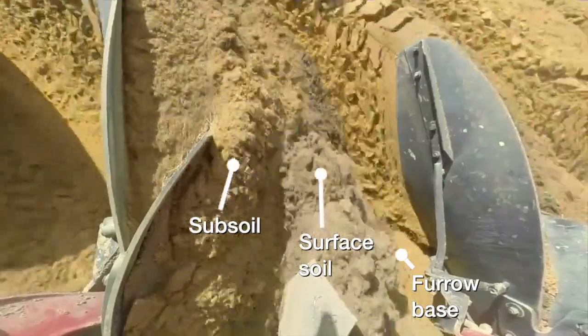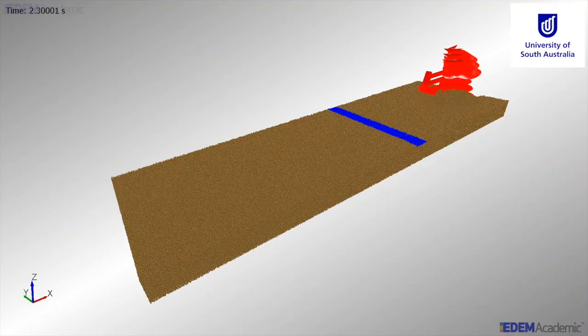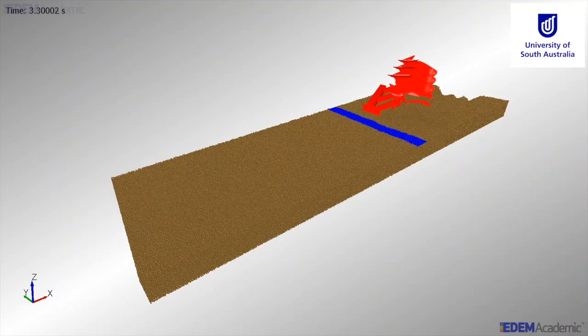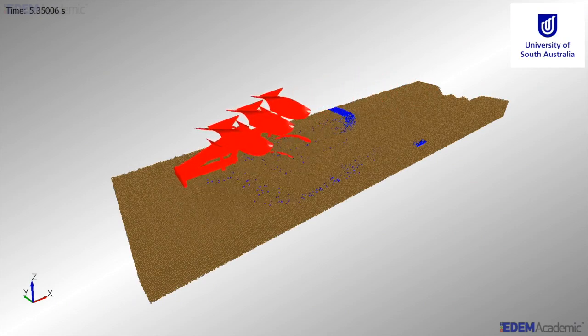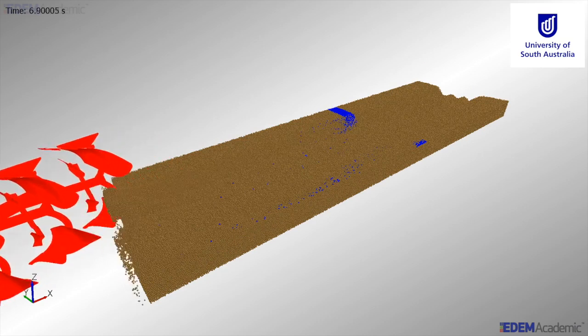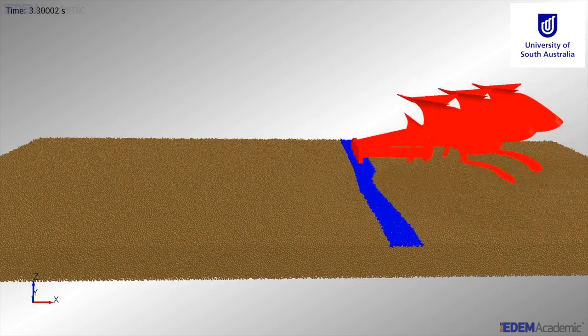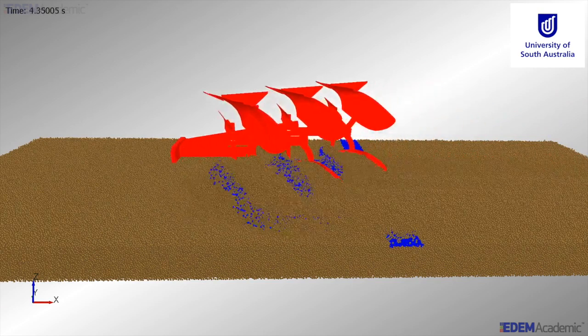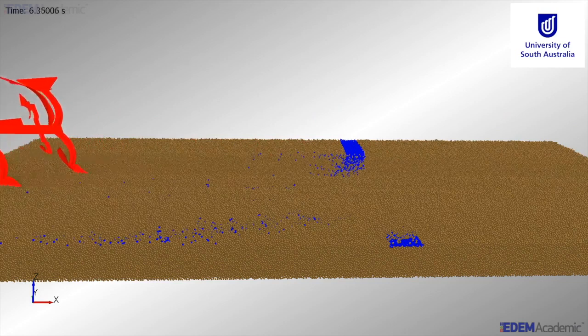Several of the most critical aspects of plough usage are working depth and operating speed. The aim should be to achieve the most efficient balance between effectiveness of inversion and work rate. Increasing the depth of working and speed of operation too much will increase the horsepower requirement, fuel usage, and wear rates on the tractor and plough, and the overall cost of the ploughing operation.